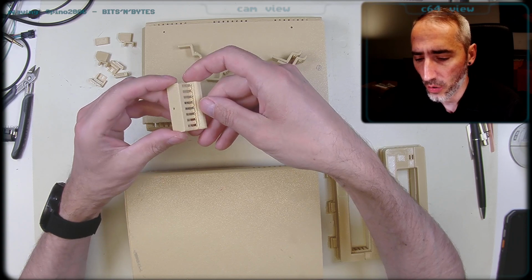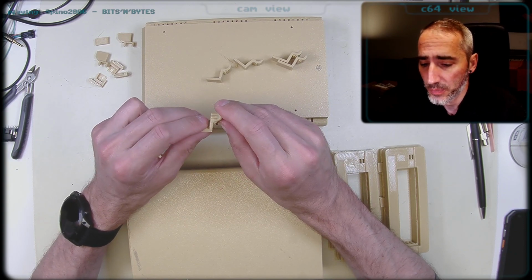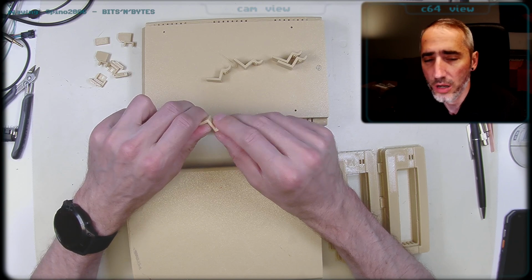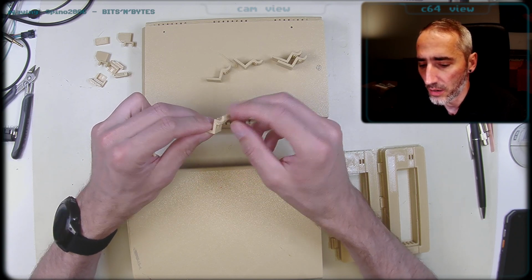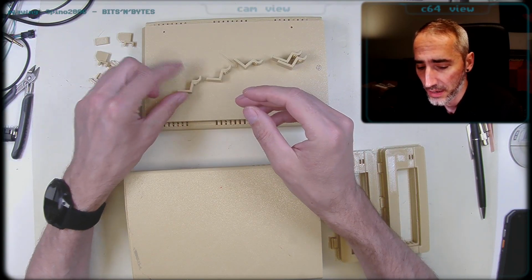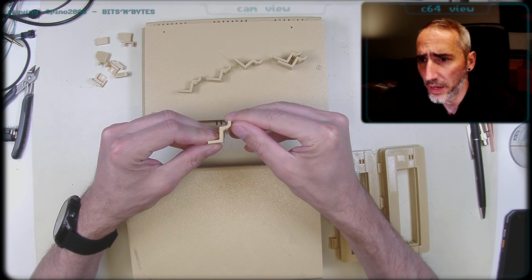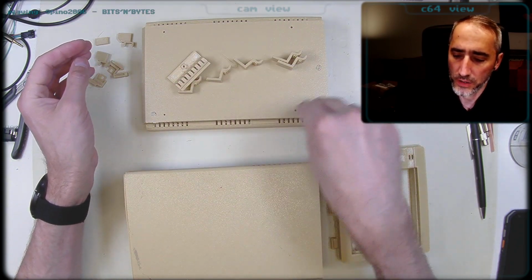And here I did a longer test, because if you print small parts like this, you run into the problem that the time the printer spends on each layer becomes pretty short, and therefore the material has no chance to cool down. The printer comes for the next layer and adds new hot material on top of it, and then the material simply bends down because it is not completely hardened, or it's not cold enough to become hard, whatever we want to call this. So I did the test with a bigger piece, and as we can see, it has improved a little bit, but as soon as we come to the bottom of this round shaped edge, the troubles are back in town, so to say. And that's usually my way to fine-tune parts like this.